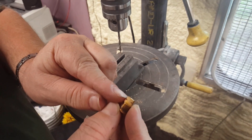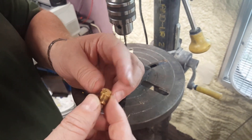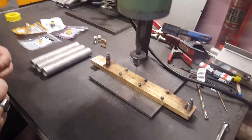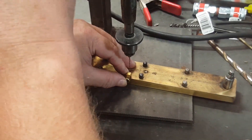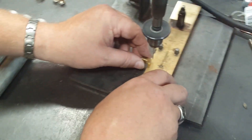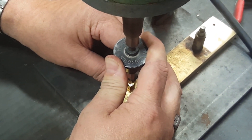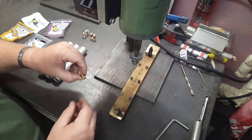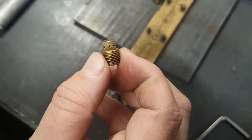What we've done is extended the hole down to about here on this cap, so when we drill through here you'll be able to get gas flowing through. We take it over to the micro drill press — this is a .042 hole. Now we have a .042 orifice in there, which will give us roughly 108,000 BTU.